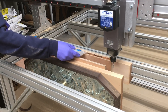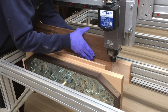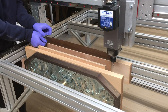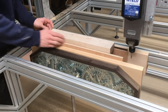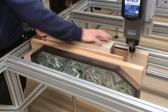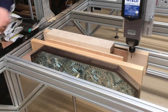I put some cork rubber on those freshly cut surfaces so that I get a better grip. This doesn't change the calibration because the work piece still bottoms out at the base of where that bit was cutting, and it's ready to make the cuts you saw at the beginning of the video. Hope you found this interesting — please get in touch if you think you have a CNC machine that would benefit from a vise. I'd love to figure out with you how best to mount it and take advantage of what it can do. Thanks for watching.